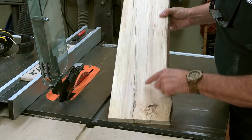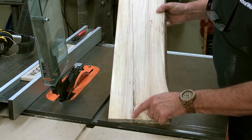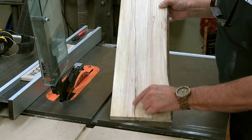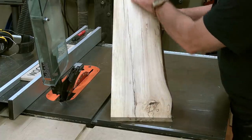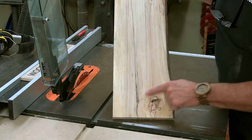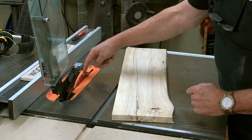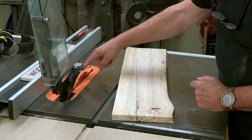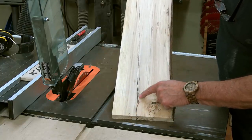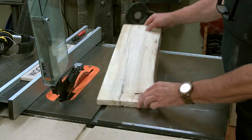Here's one way of treating defects in boards. Very often we get cracks in the ends of boards — you can see there's a nasty crack here. I wouldn't try to fill that crack; it just doesn't look good. Another way of treating this is to actually rip the board. Because this crack runs way down the board, ripping is a good way to get rid of the defect. I'll be using my Freud glue line rip blade — I'll put details in the article on WoodworkWeb. It makes such a fine cut that you won't even have to joint it afterward; it'll just come together seamlessly.